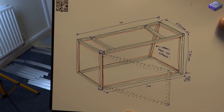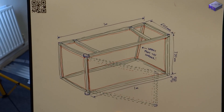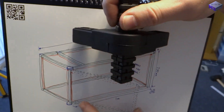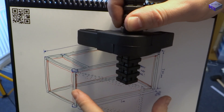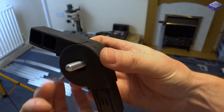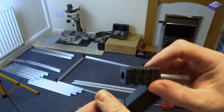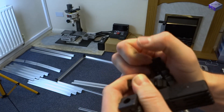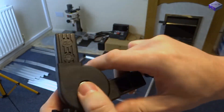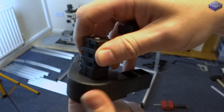So that meant a little redesign using the parts I already had, using the hinges in a different way. I opted for a door hinge on the left side that would open the whole front, which actually worked out a lot easier and made the cabinet a little bit stronger. The other problem was that the hinge has got four sections to it and I only needed three. Luckily there's one bolt going through and this fitted and locked into the top of the hinge, then I could just screw one down and add a three-part hinge. Sorted!